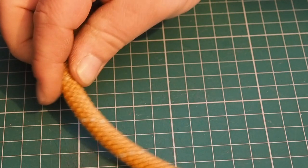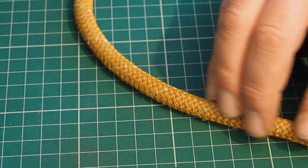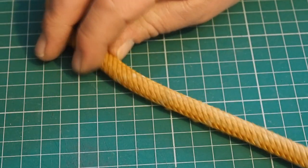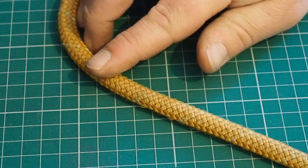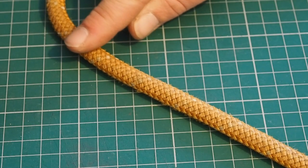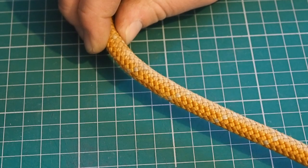Linked to that melting example, here I've got a piece of rope that's been glazed. Visually this is really tricky to spot — it very much relies on feeling along the rope. It's rough, spiky, a bit like sandpaper, and not as badly melted as the previous example, but you can definitely feel it's gone plasticky and hard. This is typically caused by lowering people too fast or abseiling too fast, and it'll happen quicker on dry ropes than wet ones. Even so, treat this glazing like it's heavy abrasion — that heat has chemically altered the fibres of the rope. That's definitely being retired and scrapped.